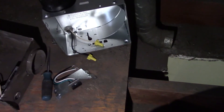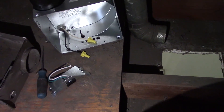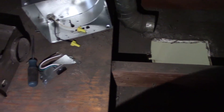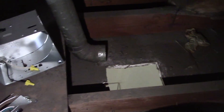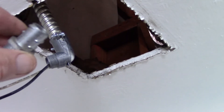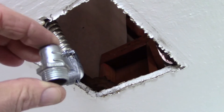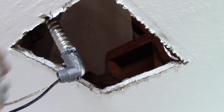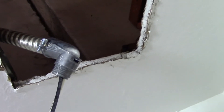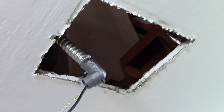That's what it looks like from up here. The power was off and I checked with a multimeter just to make sure. And then I always check the live wire with the back of my fingers — in case there is power, if my hand clenches shut I don't get zapped. So with the box in position, we'll finish up down below. The first thing I did was change the fitting on the end of the conduit because the position of the outlet in the new box is a little further away from the source, which meant there was going to be quite a bend on the conduit. By putting this fitting on, the flexible conduit can lay flat and then poke into the box at a right angle. So let's go upstairs and mount the box.